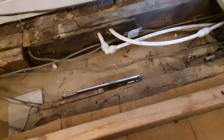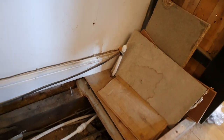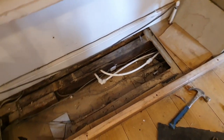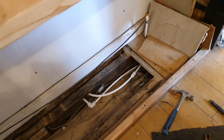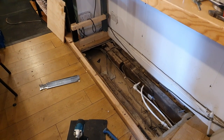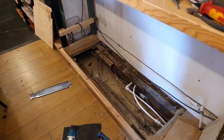Once I've got rid of that pipe, we can put the boards back down and the cover cap back on, get the fridge back in. Just a recap from yesterday: we've had to split the ring main into two radial circuits to remove a dodgy piece of cable which failed an insulation resistance test. I've been downstairs and tested it again from the circuit board and everything's reading off-scale high for resistance between both line conductors and earth, and also between both line conductors - which is a good result.